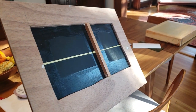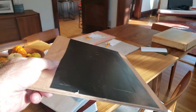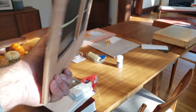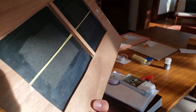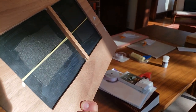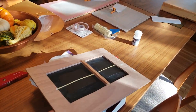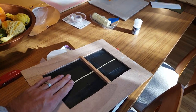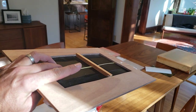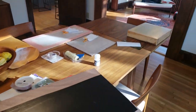The application for Oratex requires a waterborne dispersion hot-melt adhesive — you paint it on both the frame and the fabric. You can see a corner here where it's lifted, and it does not tear — you can pull on it as hard as you can. The hard part for our boats is I don't want to have to paint a negative of the stringers onto the fabric before gluing it down — that seems really hard. Also, we don't get a secondary bond by default on the Kevlar stringers, which is problematic. I want the fabric to be attached to provide some tensile strength.